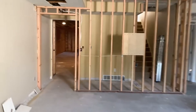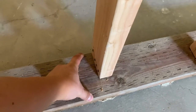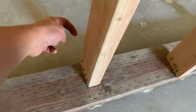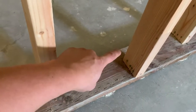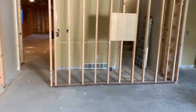Here we framed up this wall, and one thing I wanted to show you is that it's a party wall — it basically separates the owners from the tenants. We have a five-and-a-half-inch two-by-six and then framed it with two-by-fours alternating from side to side. Sound from either side will hit those alternating studs and stop at the sound insulation we're installing today. Those studs alternate all the way down to really help with privacy and keeping sound on each side of the wall where it should be.